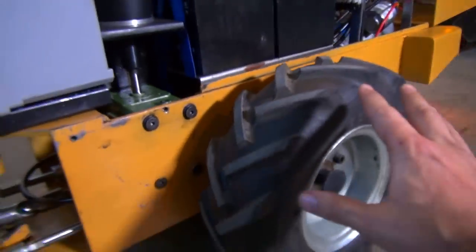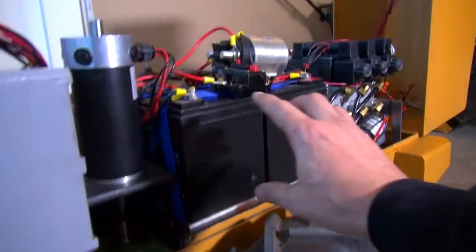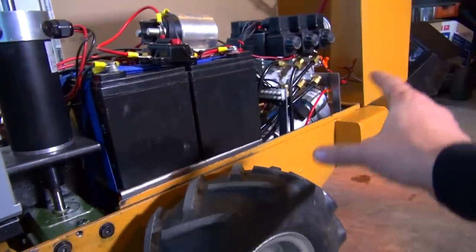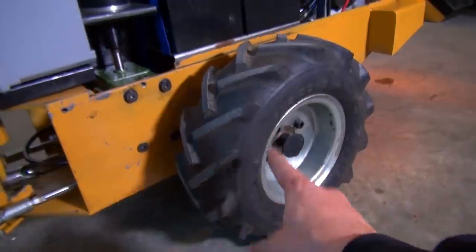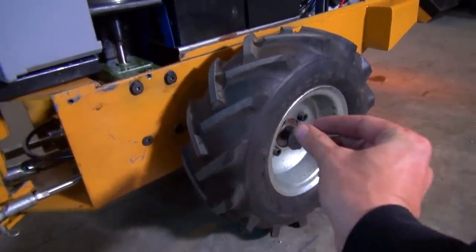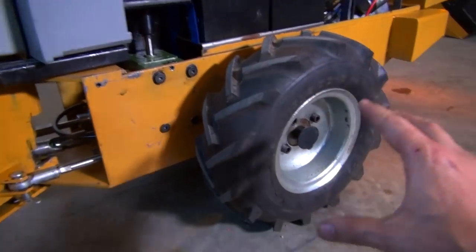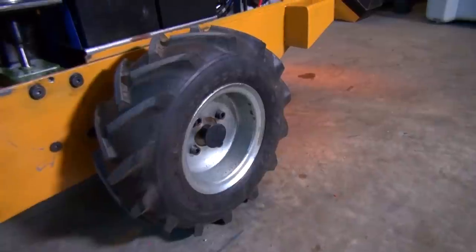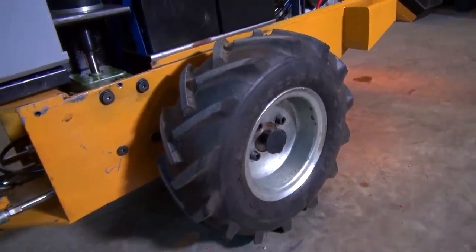I think just learning about this machine right now is something I have to put a great deal of time into. Even though I just rebuilt this axle, I want to open it up again — even though I have to take all of this out, the whole hydraulic pump, everything — and just check the gear mesh. I did mesh it and gave it quite a good gap, because I know that it's locked all the time and being on cement is kind of tough, so I give it a little bit of play. But it almost sounds like it's too tight.